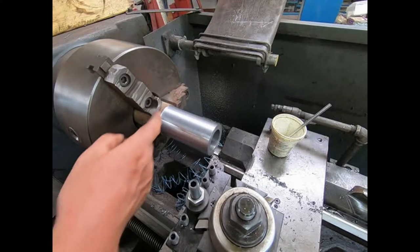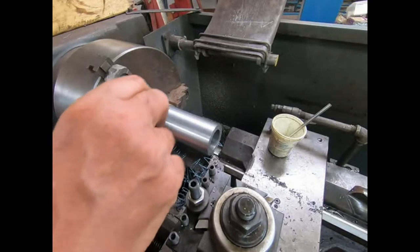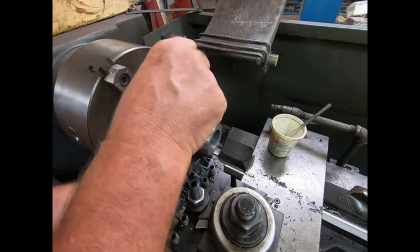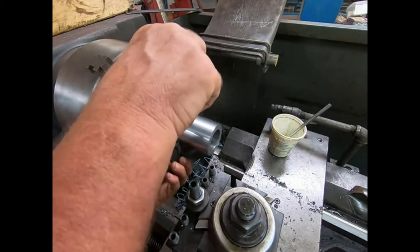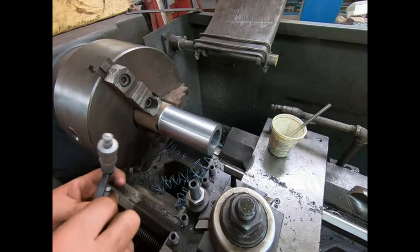Yeah, we're going good. That tool cuts a lot better at 600 some RPM. You get nice little blue chips off of it, but I'll tell you, they burn the crap out of you if they hit you. So I'd just soon go a little slower, which I am.